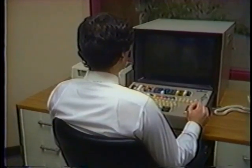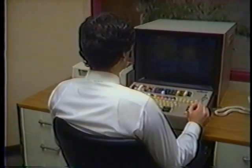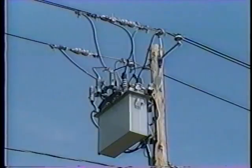Normally, fault studies are carried out by your company's engineering department to provide maximum and minimum levels of fault expected at each location. When setting the time dial, we have to take into consideration the minimum level of fault current at the end of the line. We do not want this fault current to flow for an extended period of time and cause damage.